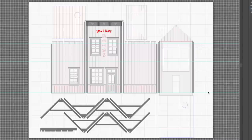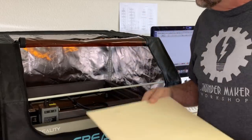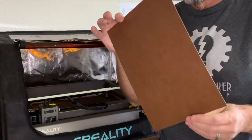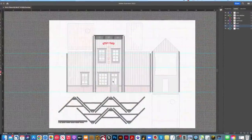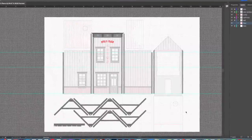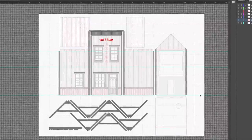Here's where it really helps to be familiar with the materials you'll be using. For this O-scale structure, as with most of my structures, I'll be using some 1/16 inch thick basswood, some medium density fiberboard or MDF of the same thickness, and some 25/1000ths of an inch thick brown laser board. Knowing the thicknesses and cutting properties of these various materials will really help me in laying out the parts and deciding which parts get made out of what. If you're new to laser cutting, you might also want to check out my video on laser cutting materials, link in the description below.